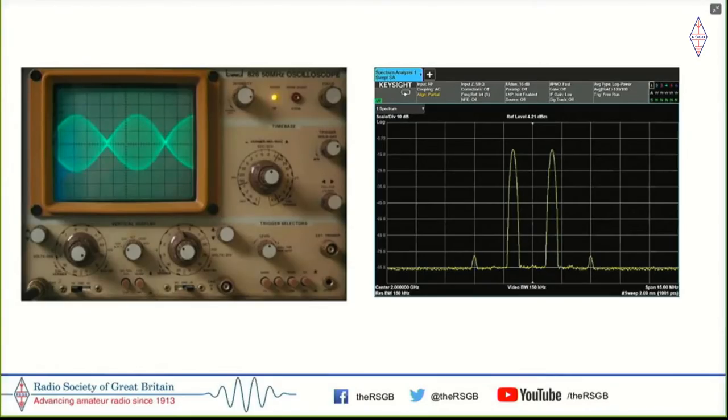Instead of that, if you view it as various frequencies which are coming to you all at once, and you say, okay, those are the frequencies that I want to be picked up, translated to some other frequency, etc., that would be much easier for us to deal with, where you say, okay, I need a filter which works between 7010 and 7013 kilohertz, because I'm just interested in a 3 kilohertz slice there. So how do you do that? So the magic is simply one function that you should call from your code called FFT, fast Fourier transform.